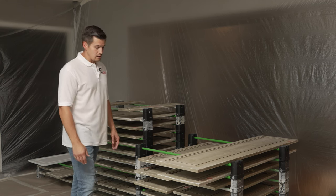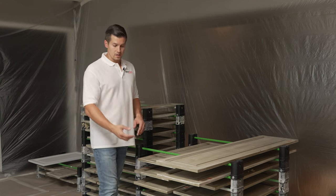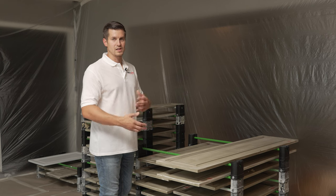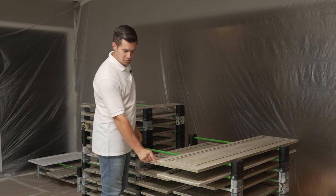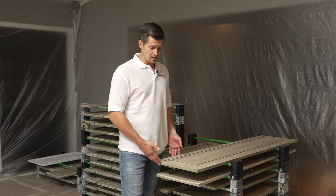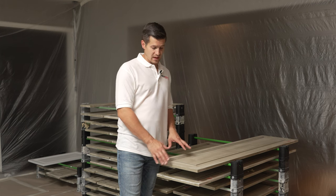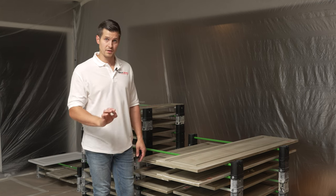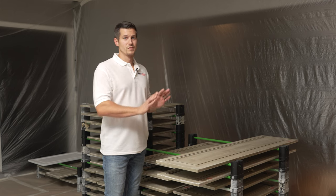I found this method faster than the hanging method because I don't have to deal with drilling in the top, putting eye hooks, and hanging on string systems — I find that to be a lot of work. This is easier: as I spray flat I'm also able to get my outside edges. A lot of painters neglect the outside edge thinking it doesn't get as much traffic, but I think it's just as important. Spraying doors flat lets you get all outside edges properly with the proper thickness, and thickness is super important for the longevity of your paint.